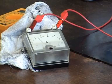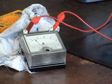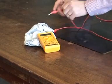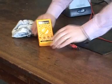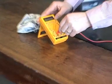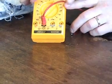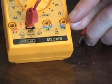Now I'm going to show that there is no difference between the analog ammeter and the digital ammeter. I disconnect the analog ammeter and put in the digital ammeter — the multimeter. When using a multimeter, you always put one lead into common, and the other goes into whatever you're measuring. In this case I'm measuring current, and I have two options: one that says milliamps (mA), and one that says 10A.